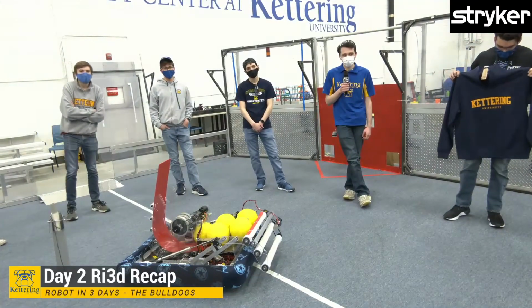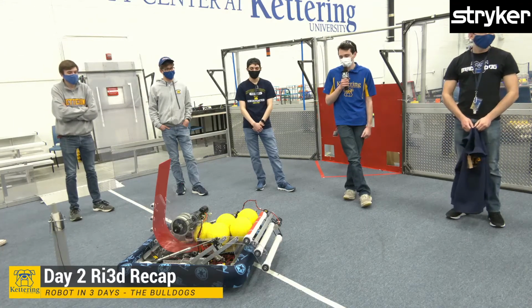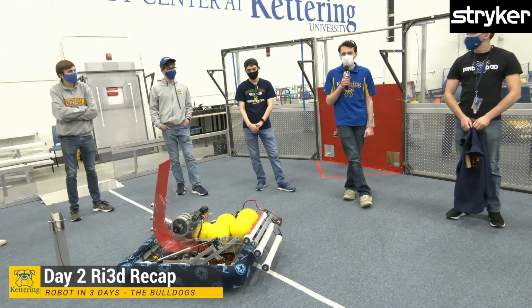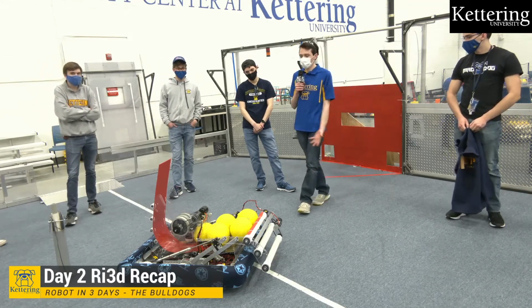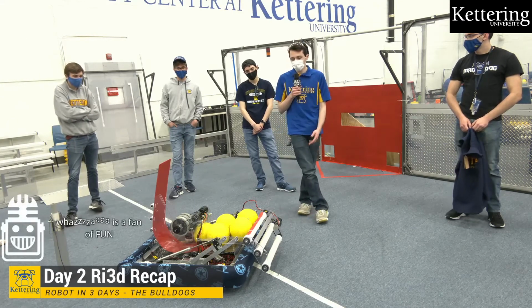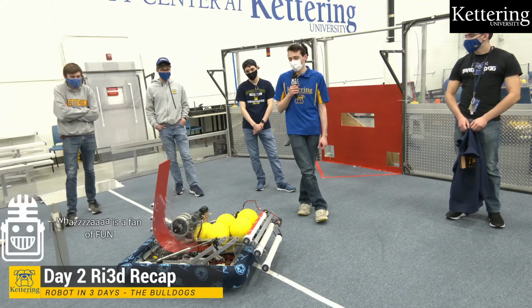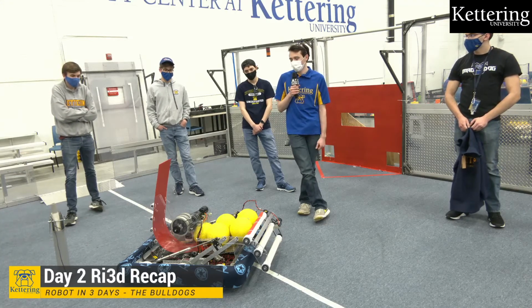Can somebody go through what motors you're using on the robot, and then any gear ratios you want to talk about as well too? Okay, we're using Falcons for our shooter. The main reason why we did this is so we can have feedback control pretty easily. And then they're also just way more powerful than any other motor we have available. They're belted. I think it's 2-to-1.